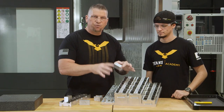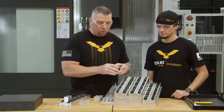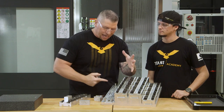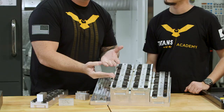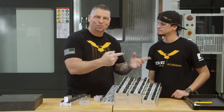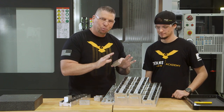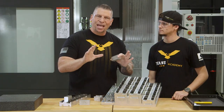So this is a fixture we came up with that allows you to do just that. This fixture fits on a five-axis table and allows you to actually run 16 different parts at a time. You can flip down and hit all the parts on the lower level, then move up and you have more parts on the center level. Stuart is going to come in as a technician and explain the process — why we designed the fixture and how it works exactly.